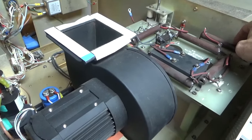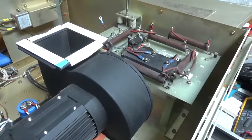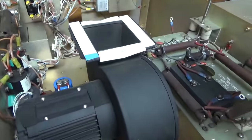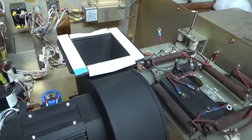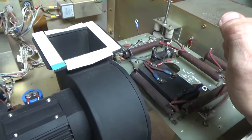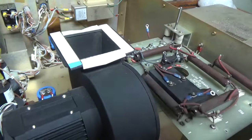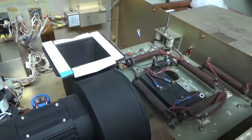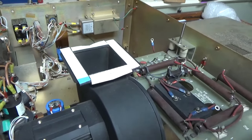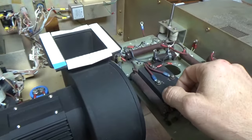Another thing Jim actually suggested I add. This is a 3CX6000. This tube costs less money. I'll say it again: this tube costs less money than a brand new 3CX1500A7 tube if you bought one from Eimac. I would never run a non-Eimac tube for that tube. For the 8877, this tube also has a really robust grid, and it's instant on.